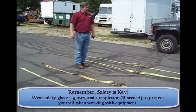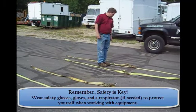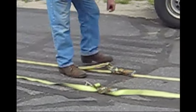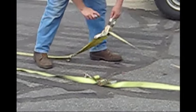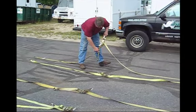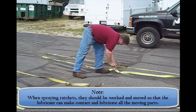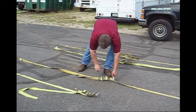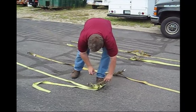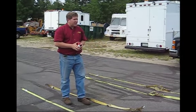For our spreaders, to tie them down, we obviously have tie-downs. We use these ratcheting straps and the mechanisms on them need to be lubricated as well. We spray the mechanisms here on both sides and occasionally the spring if it needs it on all four. Our experience is that they freeze up — the salt gets in there, or debris, or whatever else decides to get in there. It's not that they won't ratchet; it's that they won't release.